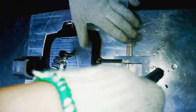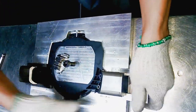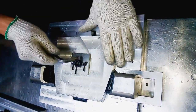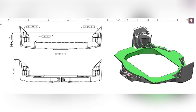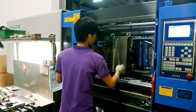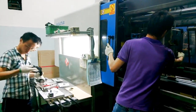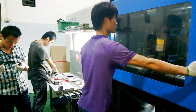What my colleague is doing is tapping the loose inserts for the plastic tool — not the cooling jigs. The reason we made loose inserts is because the wing area is unable to eject out due to the part structure. Then we put the part into the cooling jigs and let them cool down in the jigs so that the flatness can be achieved. That is the cooling plate underneath the cooling jigs — we use ice water to accelerate cooling down for the plastic part.